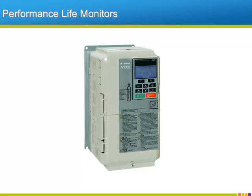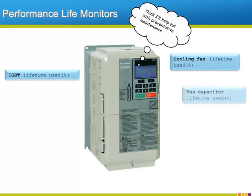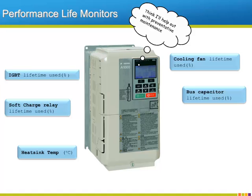One of the biggest challenges to keeping any piece of equipment in appropriate working order is to figure out which components of the equipment may be nearing a point where maintenance is necessary. Well, the A1000 wants to help out with that problem. The A1000 has display monitors that are easily accessible that will tell the user how much of the expected lifetime of the cooling fans, output transistors, bus capacitors, or soft charge relay is still left. On top of that, the current heatsink temperature is also viewable, which is a good indication of just how hard the drive is working, and may also be an indication that the heatsink needs to be cleaned off.